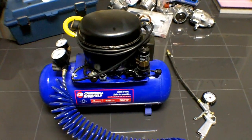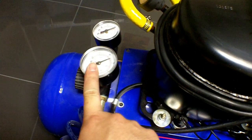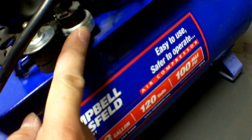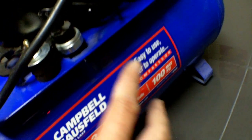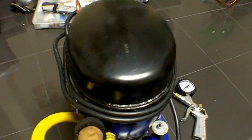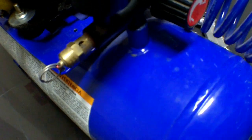Most of these parts you should be able to get from any hardware store or automotive shop. The first thing is the parts list. You need an air regulator so you can regulate your air, and an air tank to hold the compressed air. There's an electrical component on the bottom that senses when the tank is full — usually set at 100 psi, it stops the pump at 100 psi. You'll also need a safety valve in case the electrical cutoff doesn't work and it continues to pump air. This allows the air to release so your tank doesn't overfill. Mine is rated at 115 psi.